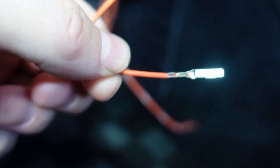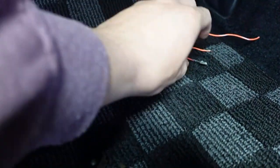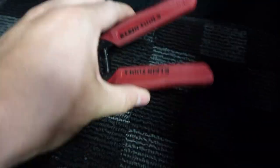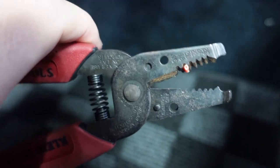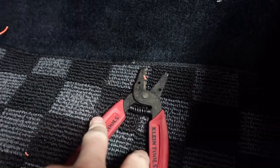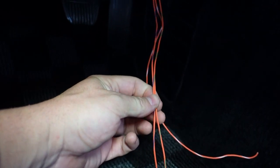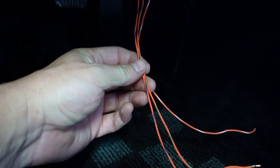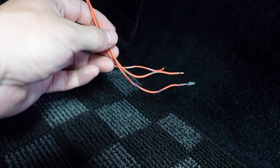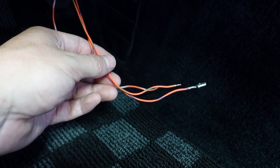I'm down here crimping right now. There are three wires Jose ran over but I only need two. I use a generic crimper — you want to get around the wire and the sheathing itself. I use Klein tool strippers; I like this style because I can get into tight areas and they go down to 26 gauge for the small stuff. I've got another set for medium size and one for 10 and 8 gauge. I'm going to crimp the other one on, wrap this wire back up, and tape it just to keep it tidy.